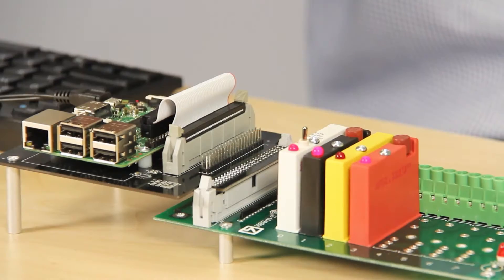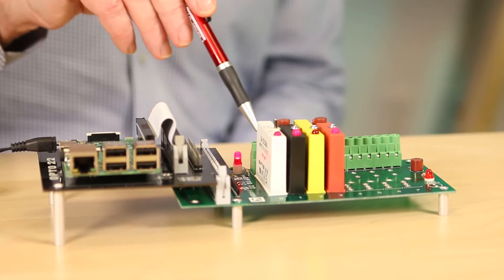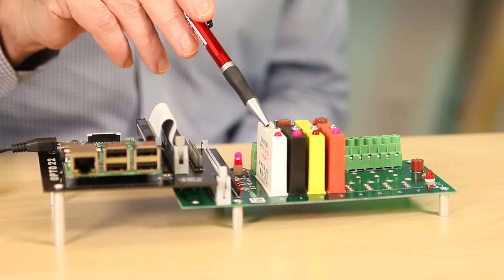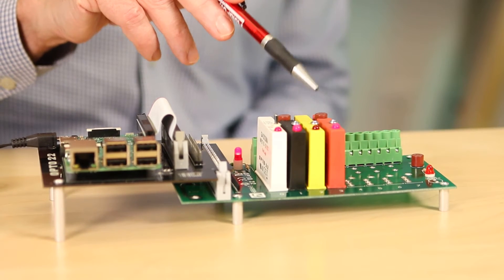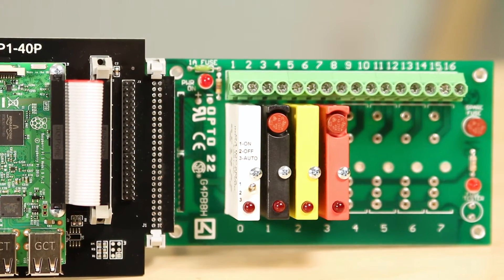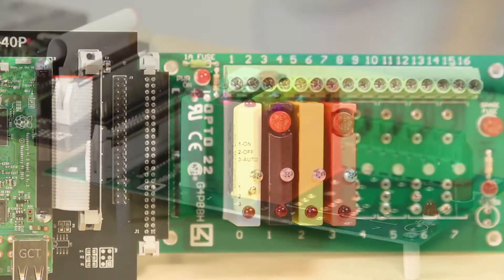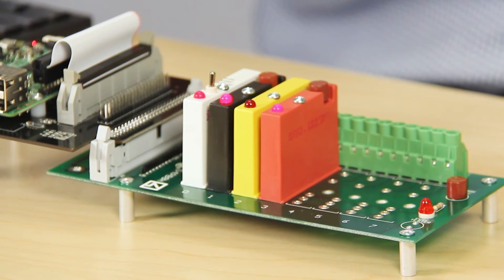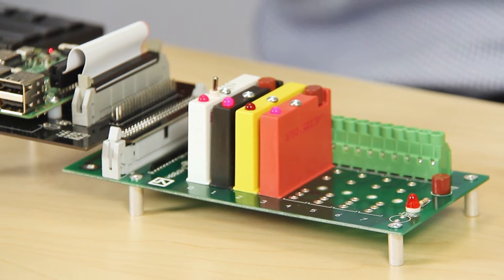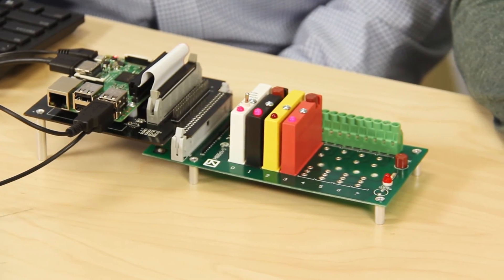There's a lot of stuff on the table here. What exactly is in the digital I/O system? The system itself includes a carrier board for the Raspberry Pi, an 8-position I/O mounting rack, and 4 I/O modules: one DC in, one AC out, one AC in, and one DC out. The I/O modules in the system aren't some watered-down version of real modules — they're the same kind you'd use in any industrial control setup. They are Opto 22 G4 input-output modules. The mounting rack will accept 4 more G4 modules, and the kit includes mounting hardware and a ribbon cable for connecting the Raspberry Pi.